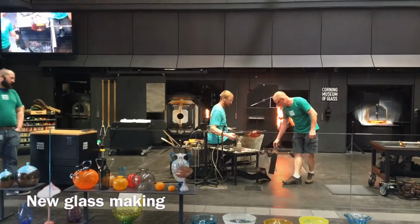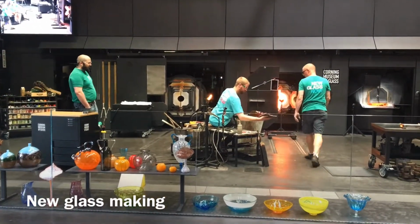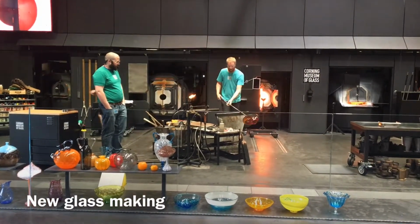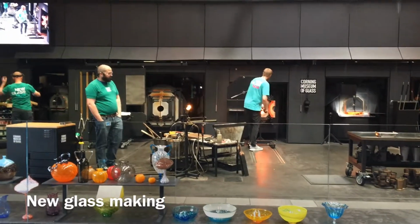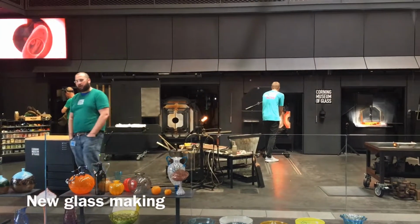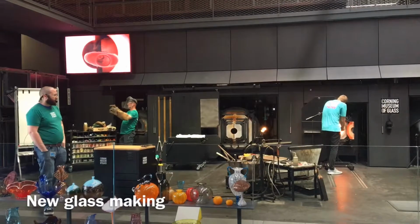All of our blocks are soaked in water. You use those early on when the glass is super molten. The paddles are going to be dry. At a certain point, it's a little riskier to use a tool that's still got water in it. The back part of that piece, the area where that punty is, that's cold enough, and if that gets water on it, it's going to start to shock it now. And you'll actually see those marks on the piece.